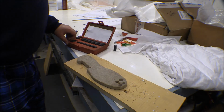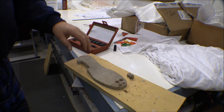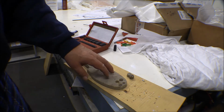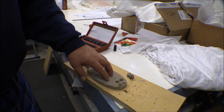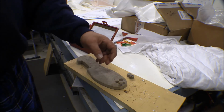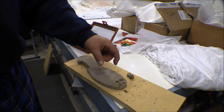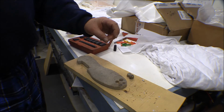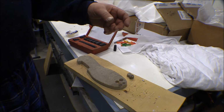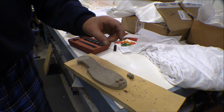One last thing I think to do before I start putting the fabric on. When I put that jack screw together, the stabilizer trim, I had a bushing put in there to put a zerk in the top bushing because they get frozen up sometimes. And after looking at it, that jack screw itself, the top of it is drilled out, so it's a chamber, a hollow, down almost an inch. And then of course the bushing itself, the metal bushing that's welded onto the fuselage, is quite a bit deeper than that. It's a couple inches deep.